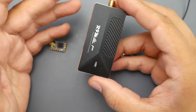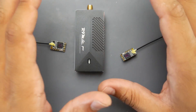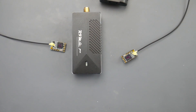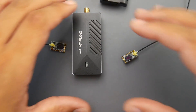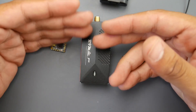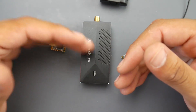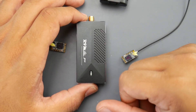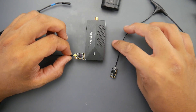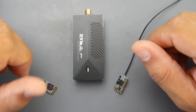The R9M Light Pro looks like a proper package for long range flying. The aluminium heatsink is a great addition especially at one watt output. I'd personally recommend picking up the one with the heatsink — it keeps components cooler, gives longer lifespan, and reduces thermal throttling risk. If it gets too hot and drops from one watt to 500 milliwatts at 20 kilometers away, you could fail-safe. Everything is linked below and I'll see you in the next one.